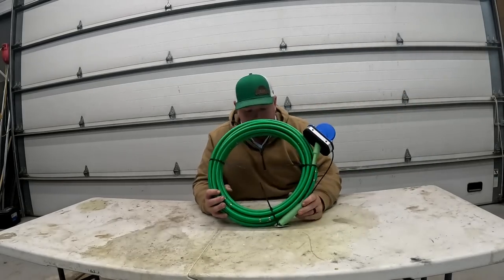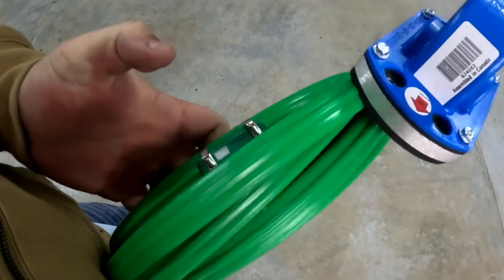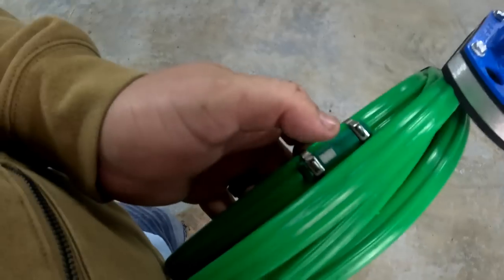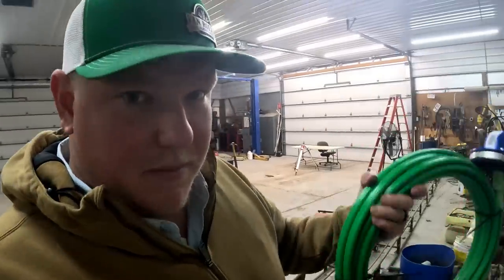At the core of this system are these cables, which will be submerged down into your grain. They have sensors that can read the temperature and moisture of the grain. You can get just temperature sensors, but you cannot get just moisture sensors — to have accurate moisture readings, you also have to know the temperature. So it's either temperature and moisture together, or just temperature.